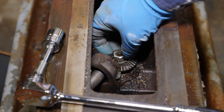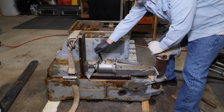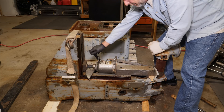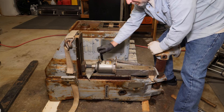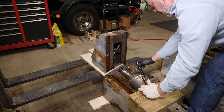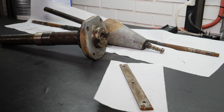I will save you my hours of trial and tribulation with the knee and just skip to the part that works. In the end I decided to remove the column and the knee from the base, which managed to remove it — it wasn't stuck on there that hard but there was no other way to get enough pressure on it. The ratchet strap is applying some downward pressure so that the knee doesn't try to tip while I'm removing it. I spent an entire day getting to this point, so it was a somewhat challenging disassembly but not terribly difficult. It will be a long video series — here's the aftermath of day one, thanks for watching. I'll show the reason for the knee jam consternation next time.